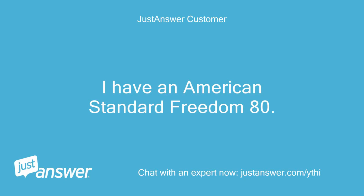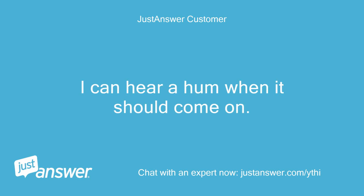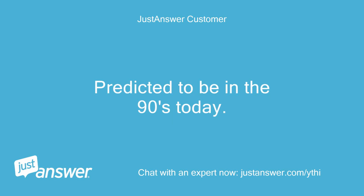I have an American Standard Freedom 80. Blower motor doesn't spin when AC is on or when thermostat set to fan on. I can hear a hum when it should come on. Control board is getting power and flashing light indicates no problems. Predicted to be in the 90s today.